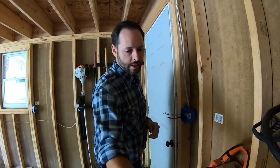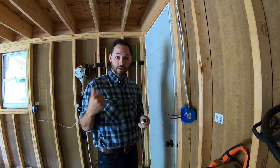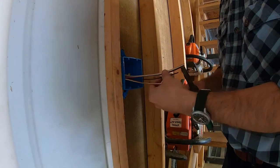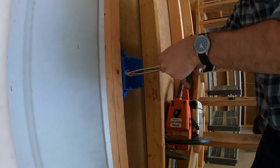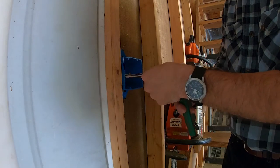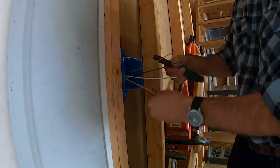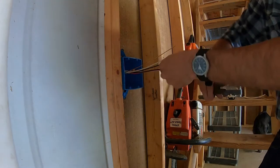So I'll go to work on this and wire it into the switch, and then we can go to the other side, cut power, and wire that other switch in. I'll bring you in a little closer and show you how I'm stripping this. You just strip these back about three-eighths of an inch — that gives you enough room to work with. So that's our power, here's our travelers, and our neutral.